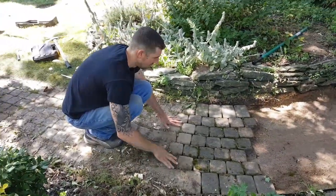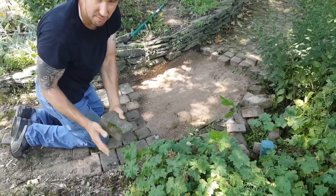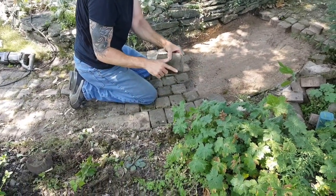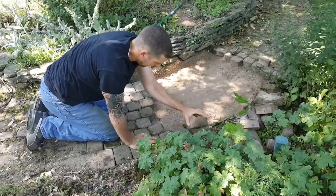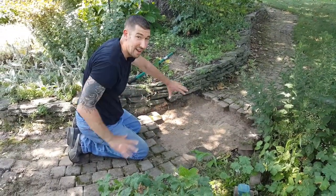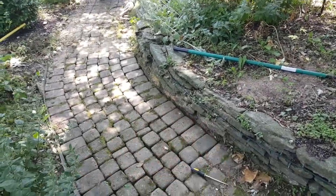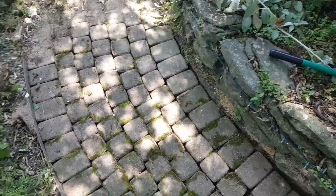Now when you're looking at a brick walk, this outside is called the soldier course, and it goes around the outside. A lot of brick walks have this on either side and it just kind of frames the whole thing in. This is where we started — this is our new brick. Make sure you clean off the dirt from the bottom of your bricks. You can get rid of the moss or leave it — it's gonna grow back anyway. Make sure you have the bricks the right way; there's usually a beveled edge on the top and the bottom is square. This does do a number on your knees — if you have a lot of brick to do, I recommend knee pads. Yes, it looks like there's big gaps in there — that's okay, that's going to be filled with sand, that's what's in the cracks here, that's where the moss grows.